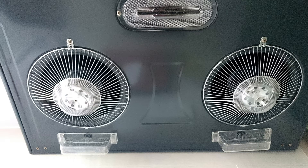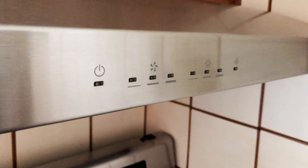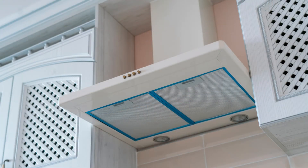To put that into perspective, stoves that range from 30 to 42 inches need a hood with a CFM rating of 600. In comparison, a large 60-inch oven requires a hood rating of 1200 CFM. Like the gas range hoods, if you're an avid cooker and have a small oven, you should choose a higher CFM. Higher CFM hoods also last longer and have high and low fan settings.